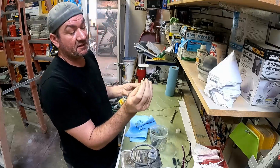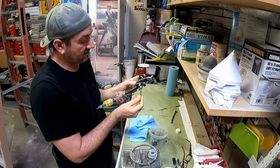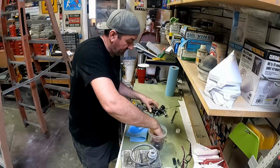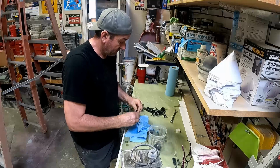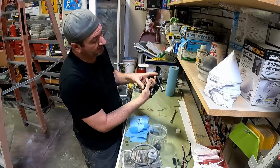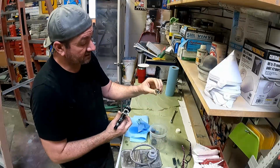This one has a little bit of a plastic cap, but this slides over. You can see the needle sticks out, slides over that, and then keeps that pressed up against that cap. So have the little plastic thing facing the back when you put it back together. Get this guy, just kind of squish him in there. And then anytime you squeeze the trigger, that spring is forcing that needle back up to seat against this.